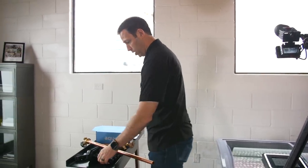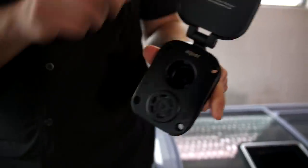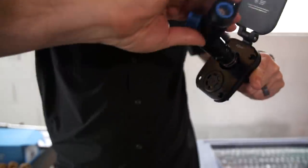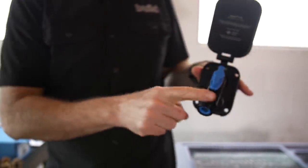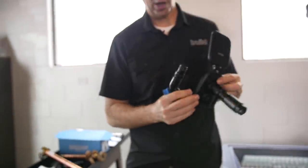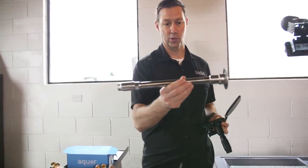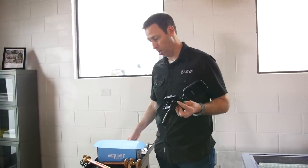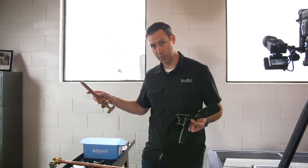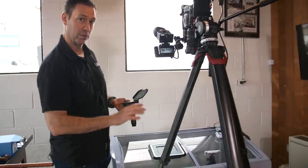Aquor makes another model of a hose bib which is pretty sleek. This black one — the cover on the outside of the house is all you see. You insert one of these, which becomes the hose bib where you can shut it off, and when you take it out it's shutting off back into the wall. This is the four-inch model; they also make a 12-inch model. The difference between these models is the materials. This one is copper, and the one I installed on this freezer is brass. The Aquor, though, is made from stainless steel — which is much less thermally conductive than brass or copper.